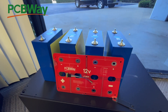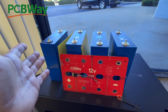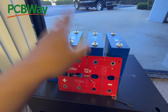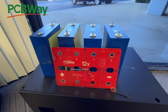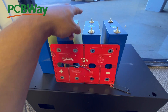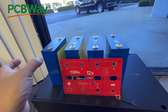It's very competitive. These last forever — rated at 6,000 to 8,000 cycles, but if you use them lightly and don't fully discharge them, you can get up to 10,000 cycles based on reports from people using them. They come in several sizes with the same physical dimensions: 280 amp-hours, 304 amp-hours, or 314 amp-hours, with some testing as high as 330 amp-hours. The 314s are the most expensive of the bunch, but really huge batteries for the same physical footprint.